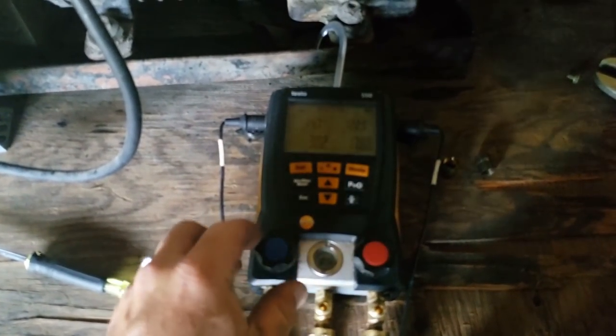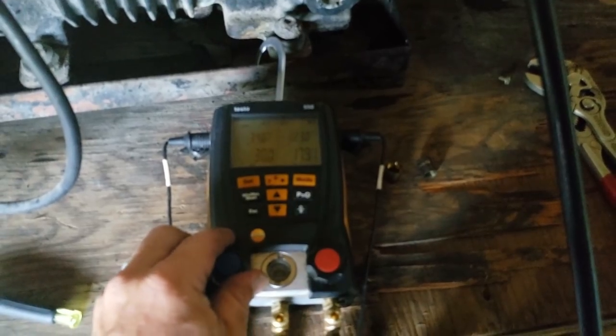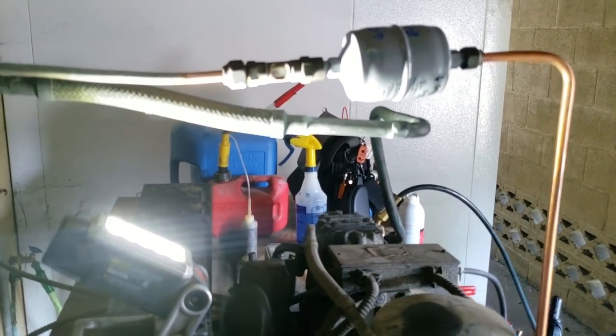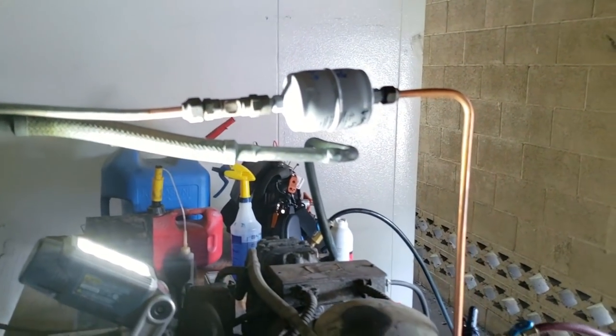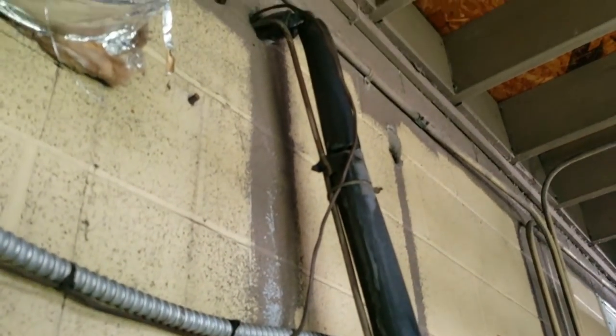She's running a little higher head — 123 degree condensing temperature. And all I can do is recommend stuff, but I think they're going to want to try to keep all the costs down. And this thing is what we call tired. Very tired.